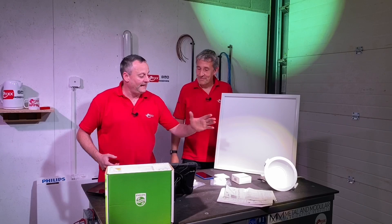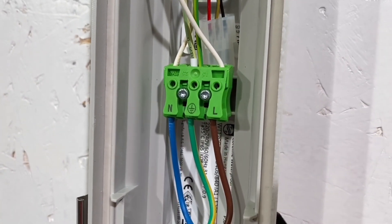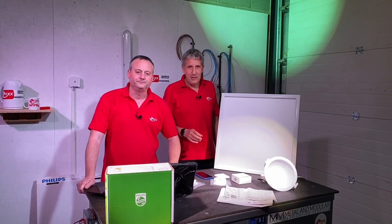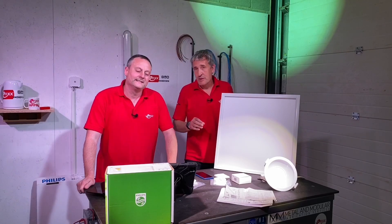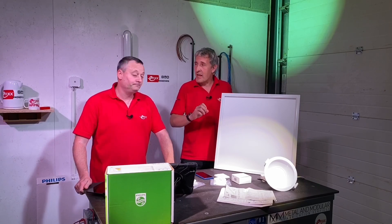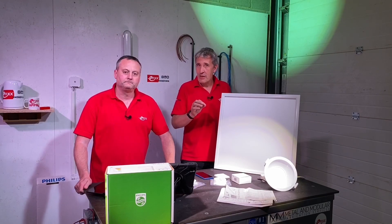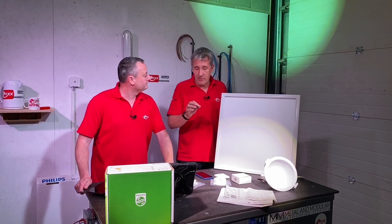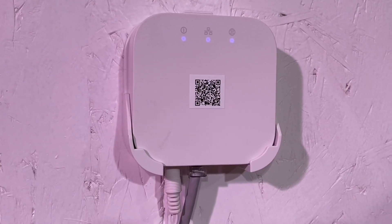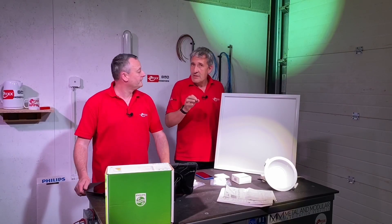You had me busily going round to each of the three lighting points, making a simple connection for Line, Neutral and CPC. Normally when you think of lighting control systems of the past, you'd be thinking specialist wiring, commissioning visits, laptops. This system is different — it's incredibly easy to commission and manage. All it needs is a mobile phone and a hub which connects to the internet, and then communication between all elements is easy with a wireless protocol.